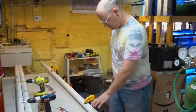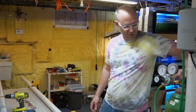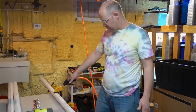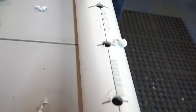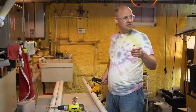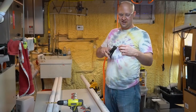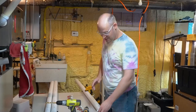Now we've got the taps done and threaded, and we're just about ready to install the valves. But first we're going to take the air compressor and blow out the pipe, because all those little pieces of PVC from drilling and threading are stuck inside. If you don't clean it out and you put your valve in and turn on the water, that debris comes in and clogs your valves. I didn't do that the first time I ever did an auto water change system, and I kept wondering why they were clogging — it took months to finally clear it out. So always clear out your tubing first.